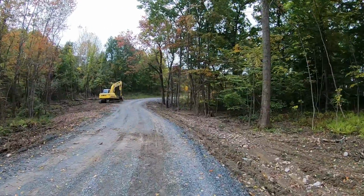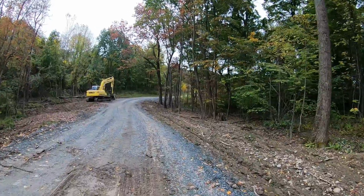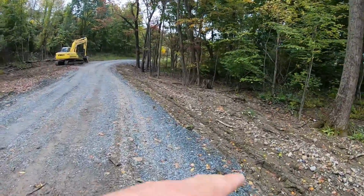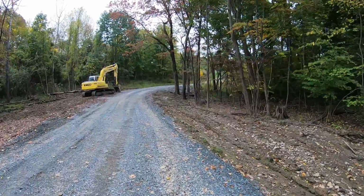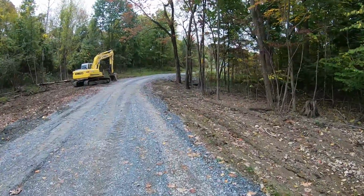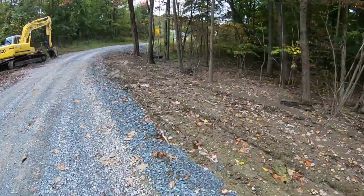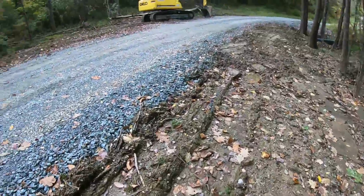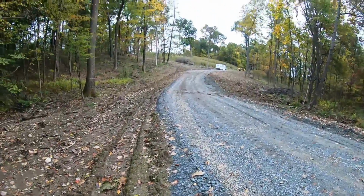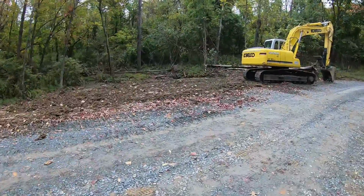Consolidating all this stone that we had dumped off here originally, and putting it up on top so we could grade this all the way around. We got some piles of dirt in there, so we could get some mobile area on finished grade. Obviously this is just wet muck we're putting in. You can't really doze it off too much. I mean, it's pretty hard now, so we'll give it one pass with the dozer.